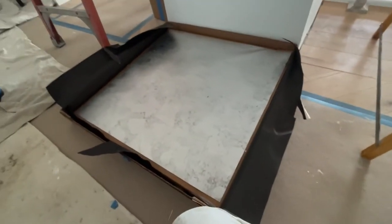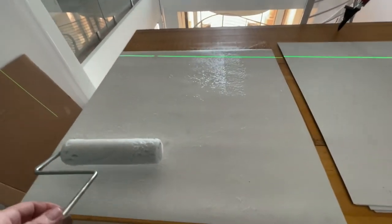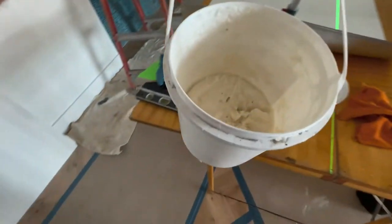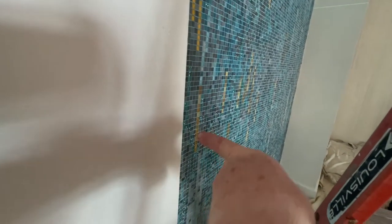These are handmade and they are hand painted as well. One of the best products on the market. Okay, that cross represents the four corners of the beginning of the installation. So with one wallpaper table, I roll my panels here and I bring them over to my other table over here. Now I've taken my VOV, my heavy duty vinyl over vinyl paste, and I've put it in my inside corner, at my edge, and most importantly, right there on this outside corner, this side and the other one.